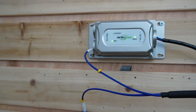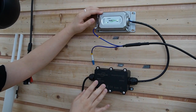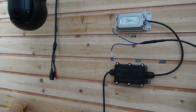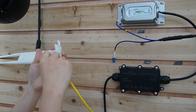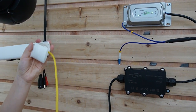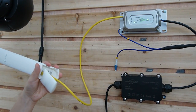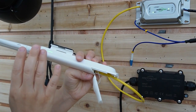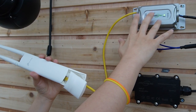This is the outdoor power supply set, and those two units are completely IP67 waterproof, so they can work under harsh environments. Let's try the wireless access point first. We are going to connect the wireless access point here using an Ethernet cable — it can be powered by PoE. So I'm going to connect it with the media converter, and you can see the indicator lights are both on.